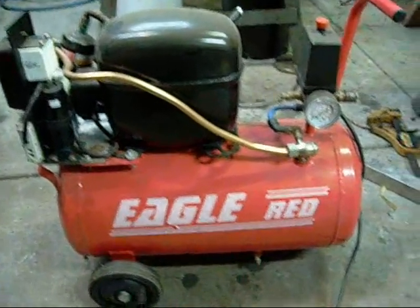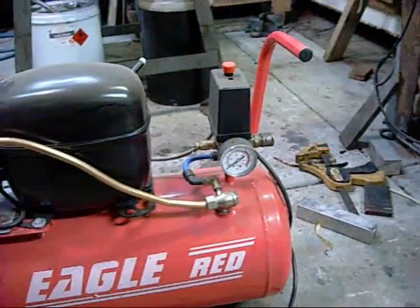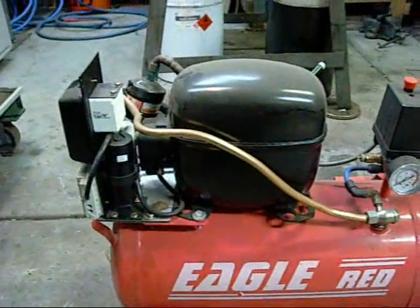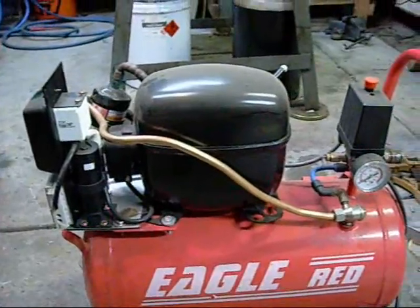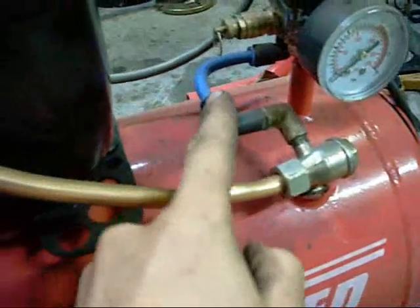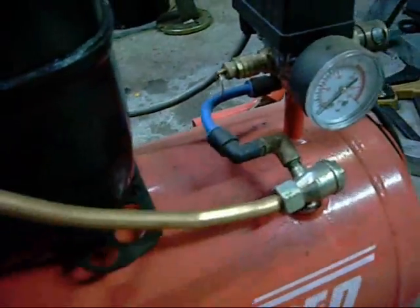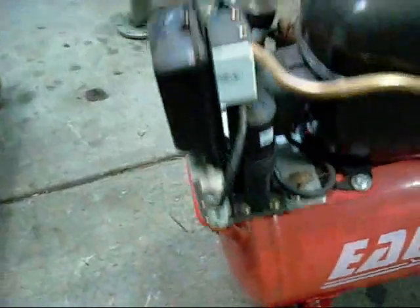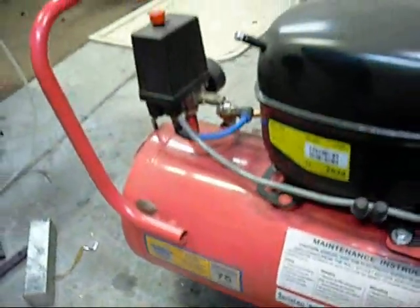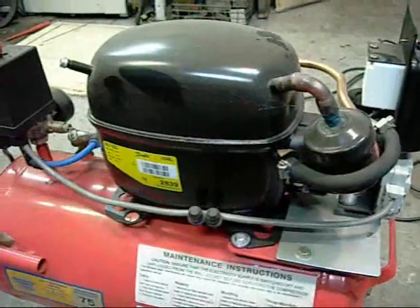This little one here I built using a surplus air tank. The tank is brand new and so is the switch — it came from my neighbour who bought one just for the compressor pump and discarded the tank. The compressor is just a commercial single cylinder reciprocating compressor. This is the original discharge hose from the compressor — I had to replace this one since I knocked the thin aluminium tube and broke it. These normal compressors cost roughly 50 bucks each, so they're pretty cheap. You just rip the noisy old AC compressor off the top and put a fridge compressor on it.